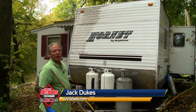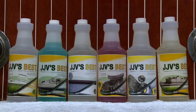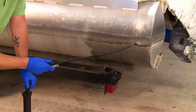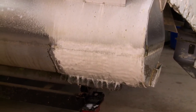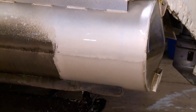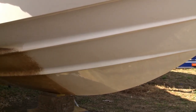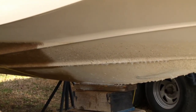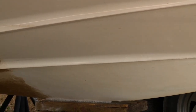Two great new products to add to JJV's Best current lineup, including aluminum pontoon cleaner. Simply apply at full strength with a dedicated Hudson sprayer on dry bare aluminum, applying from the bottom up and completely covering the surface area. A foaming action will take place. Allow three to five minutes of dwell time, then thoroughly rinse with a pressure washer from top to bottom. Boat Scum Remover is designed for use on both painted aluminum and fiberglass hulls to remove heavy scum, algae, and mineral buildup from below the waterline. Apply on a dry surface at full strength from the bottom to the top, allow three to five minutes of dwell time keeping the surface wet, then pressure wash away years of buildup. No scrubbing required.